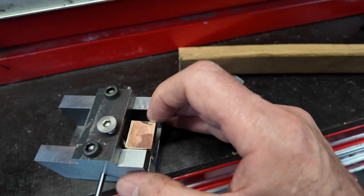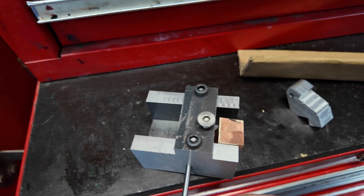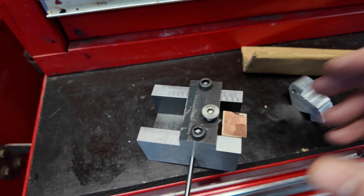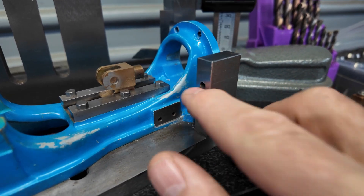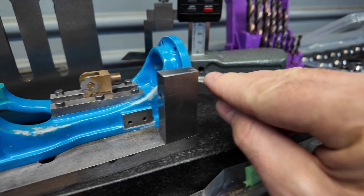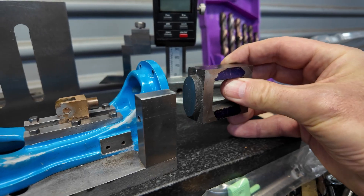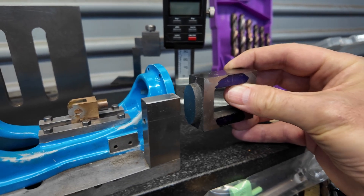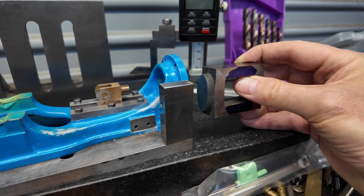We've got a predictable way of getting what we want. And if it's not quite right I can take this pin out, put it back in the mill and fine tune it exactly into place. Once this arm is lined up with this rod, we can also use both of them to mark the position of the hole in the steam chest - we haven't built the steam chest yet so we still have some flexibility. The steam chest is going to be here somewhere, and once that's mounted we can mark the position and machine to the known position, so we should have a very good alignment.